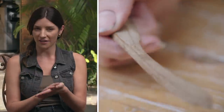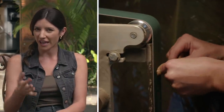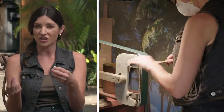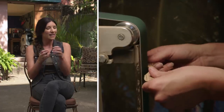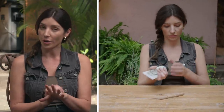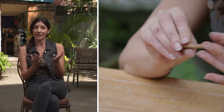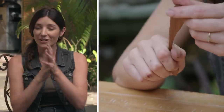This will keep the moisture out of your knife and keep a really nice, smooth finish on the blade. If you don't take the knife down to a really fine, smooth finish, it will be really uncomfortable in your hand — it'll feel sort of hairy in your fingers. Also, food will get stuck to it, and the process of it being wet and then drying will tend to dry out the knife a lot. Wood loves oil, so if you apply a mineral oil, maybe a little beeswax, that'll help keep the moisture out of the material. I like to just use my bare hands, get that oil right into the grain.